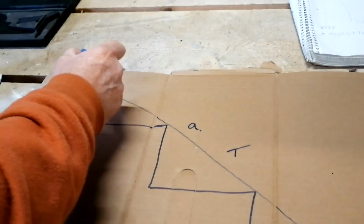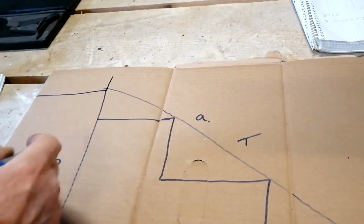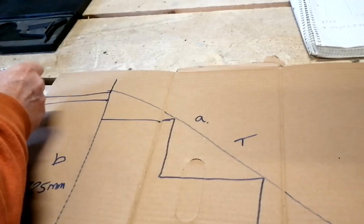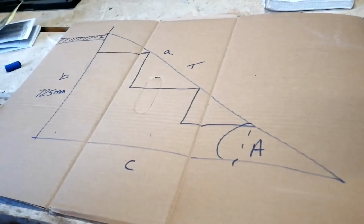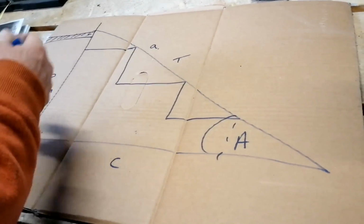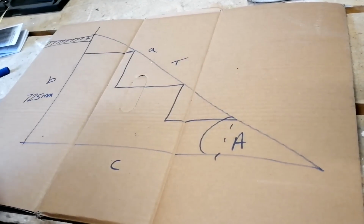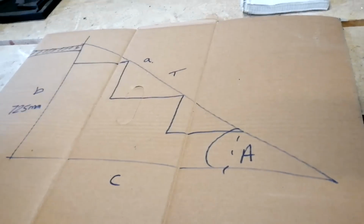And this is where our pan, which is going to be a concrete pan, is really going to attach to. So that's the landing, it's going to attach to here. And this is going to be filled in with concrete and stone. And obviously, for safety reasons, all these steps have to be the same height, else you'd trip up. As anybody knows, if they've ever been on a staircase where the bottom step is lower or higher, sometimes, old-fashioned staircases, it's a bit dangerous.